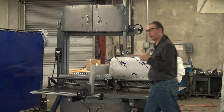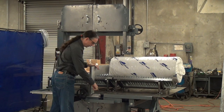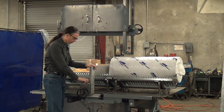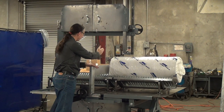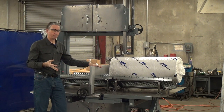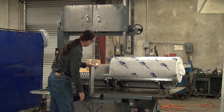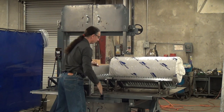This comes with a scale on the table surface with a little pointer pointing at the scale. We also offer as an option an electronic digital readout. The readout will tell you the distance from the blade to the fence face, and it can also be re-zeroed at any point — you can have it zero at the blade or any place else. So there are two ways to use this: first, you could say I want a four-inch cut piece, set the fence four inches from the blade side.